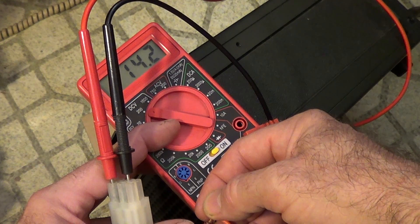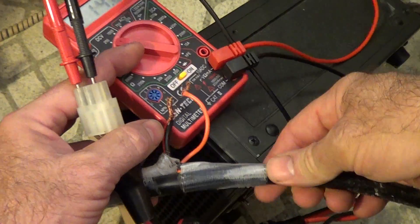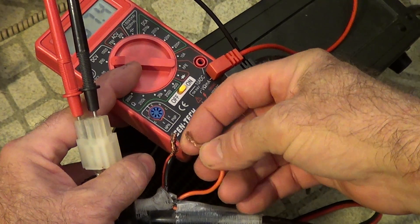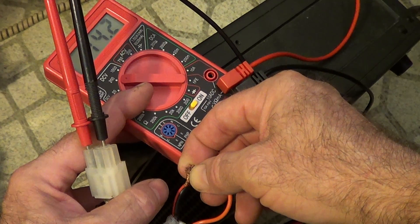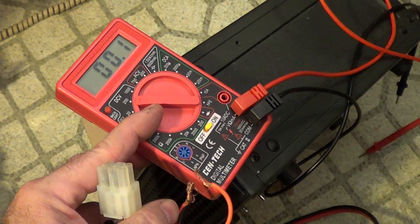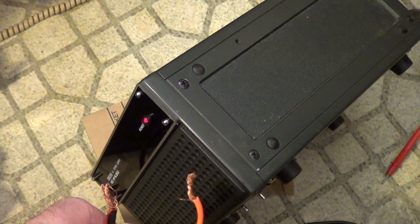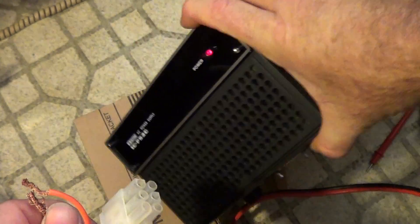At least on mine, this PS-20 power supply: you turn the switch on the back, then you ground the orange wire coming off the big connector. It's got a ground which is black and red, a red wire which is the plus 12 nominal, and then a sense or control wire that you've got to tie to ground after the switch is turned on. It's kind of strange. I just kind of didn't see anybody on the net mention this sequence — if somebody else has one of these they can comment if this is the way it's supposed to work.